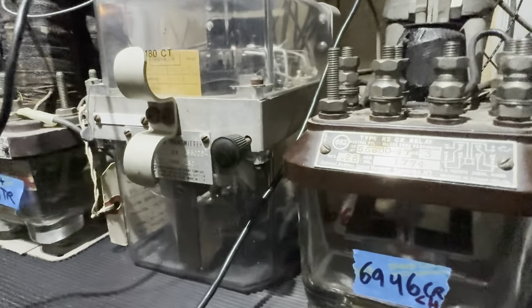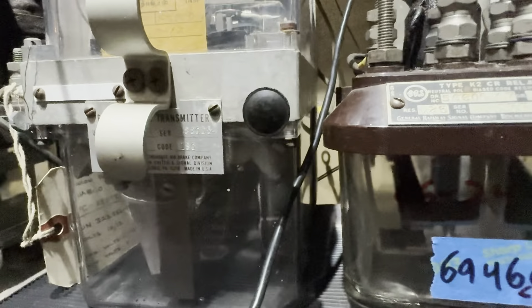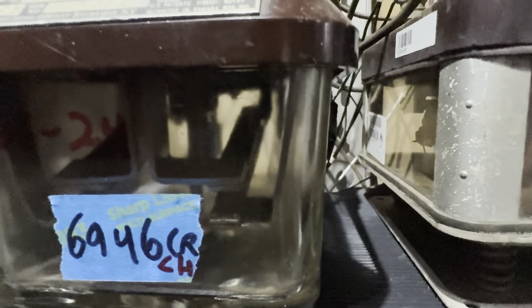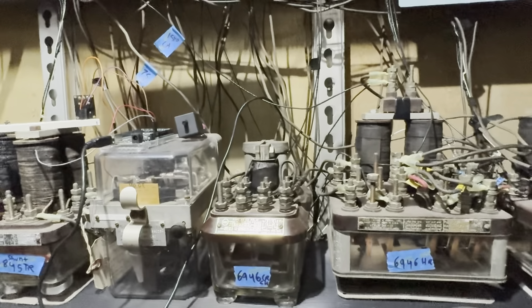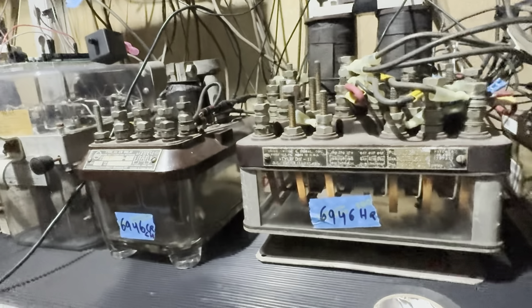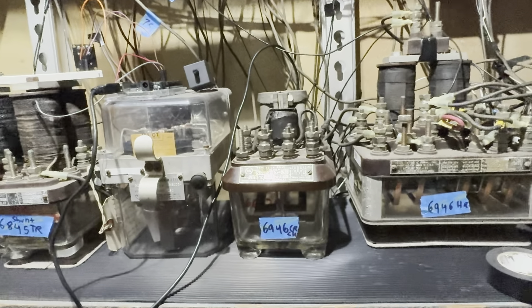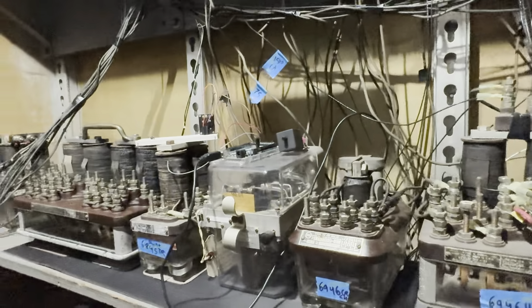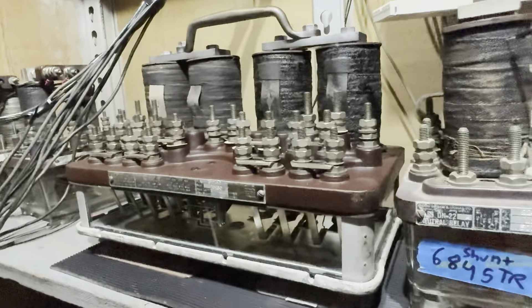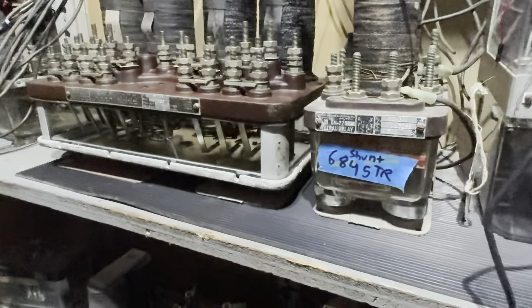Here's the 180-rate code transmitter; the 75-rate code transmitter is just a flasher relay from a vehicle — I need to get an actual code transmitter like this one. Here's a code-responsive relay — it's a fast-acting polar relay meant to be hooked to the track at 0.25 ohms. This would be used in a coded track situation: instead of pole lines carrying signals between locations, they send pulses down the track at various speeds. Here we have another DX-13 interlocking relay believed to have come off of the Frisco — it has a handle on it and is a slightly older relay.